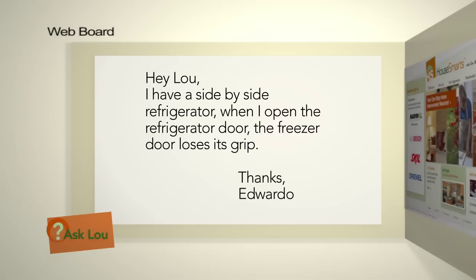On the walls, I definitely recommend using some type of moisture-proof backer board. On the floor, you can use a very thin backer board, or some tile setters like to use chicken wire and thin-set mortar — almost a thinner mud-set floor, which was done back in the 40s and 50s. It works out pretty well, but you really need to know what you're doing. A thin backer board makes quicker work of it and gives you a tile job that will last.